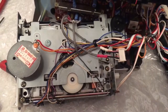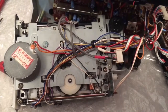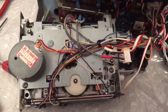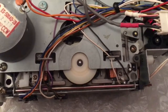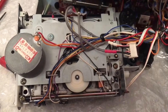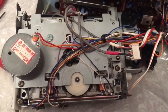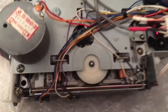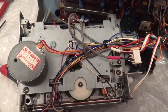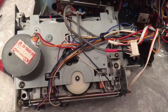Forward play, stop, reverse play, stop. See how the solenoids don't do anything when you're playing. Forward play — nothing happens. Reverse play — it does actually do something when it's reverse playing, but not the whole time. It just seems to be this little guy here on the left. If that gets stuck, you've got no rewind or fast forward. See, it's stuck again — I need to obviously lubricate that. There we go, it came good again, rewind's now working.